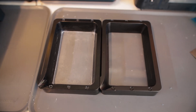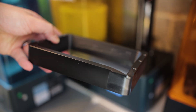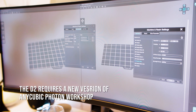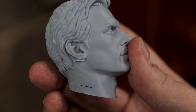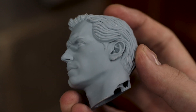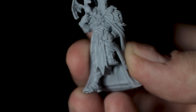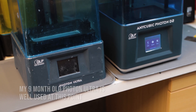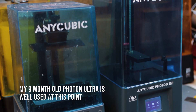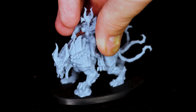Many components, such as the VAT and control screen, are identical to the previous version. I literally ported my exposure settings over from the Ultra and printed without much issue, though after a few prints I did increase exposure time from the Ultra's 1.6 seconds per layer to 1.8 seconds per layer due to efficiencies made with the power of the projector. The D2 unit is larger than the Ultra, to house the mechanics of the new projector and its new projected light area, which doubles the resolution over the previous model.